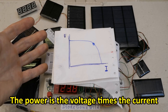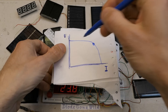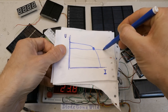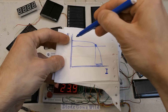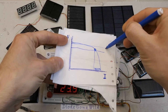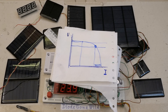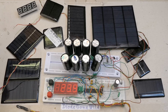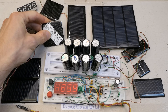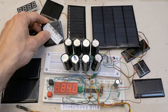When using solar cells with no controller, just connecting them to a battery or capacitor being charged, the fully charged voltage should be below the maximum power point to keep the current near the maximum. Because if the voltage is just a little bit higher on the battery or capacitor, the current is suddenly much lower. It's also better to use a solar cell rated for a bit higher voltage so it can run even at lower light.